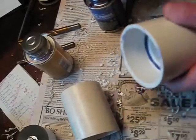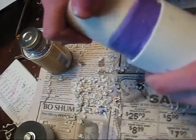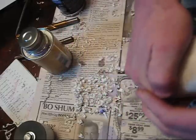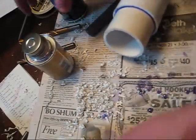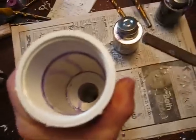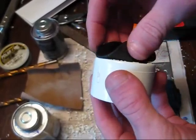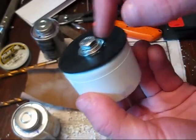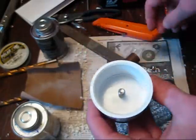This will be the short section of PVC that the piston will slide in. Attached to this short piece of PVC will be a female adapter — always the female, because your piston will not fit through a male adapter. Be aware that all pieces are schedule 40 PVC. Building the piston is simple enough: take your one-and-a-quarter inch end cap, drill a hole through it to insert a bolt, put your rubber gasket on top, then stack a few washers to hold the gasket in place.